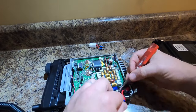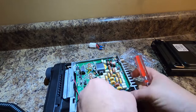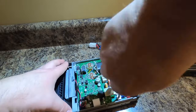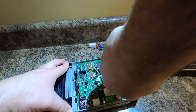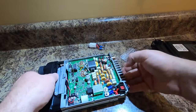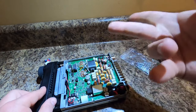What I'm unhappy about right here is the fact that this black wire didn't twist like I wanted it to. It is slightly in the way of where this red one is, so I'm going to push that out of the way. Then we'll find a place where the red one is. So there it is — that is the delete of the Molex. We got rid of that. Then we can take and put our cover back on. We'll find out if it works in a minute.